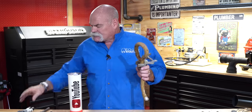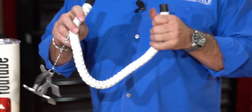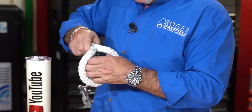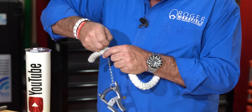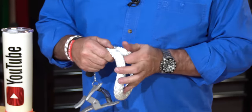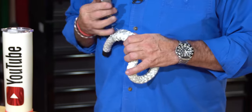Now this is an old one and this is a new one, but it's a running rope — and these were really neat. What you do is you put the running rope around your joint. Say you're doing a horizontal line, you put your running rope around that joint, pack it in, squeeze it so it goes around the pipe. You would put this around the pipe at the joint or the other fitting, whatever you're trying to join, get it where it goes right around it there, and you take your clip because this holds it together.